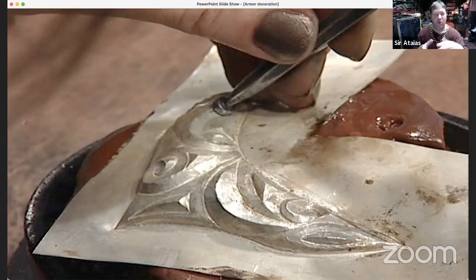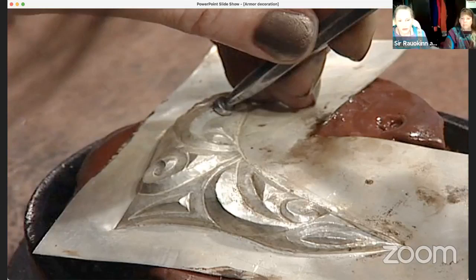Well, you have to pull some of the pitch over around the edges a little bit, or in some other way get it to adhere. Give the pitch more of a surface to grip onto, but it'll hold it in place for the most part. And as opposed to that steel plate, the pitch will give. It'll be a firm surface, but it will also give to what you're doing to it. Okay. So it allows you to push the metal around on it and yet keep it in place. So you get much more of a 3D effect.